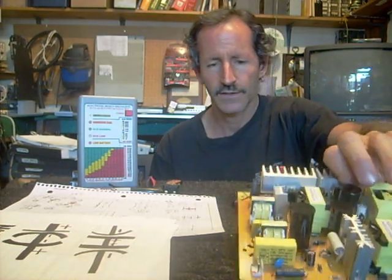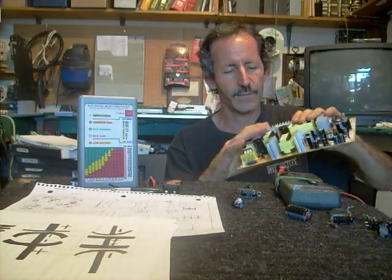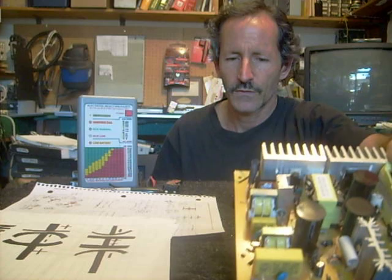So if you can find a reputable company like Digikey, learn to use their website and learn what to look for as far as the operating parameters. You want to make sure that you get a capacitor that can handle the heat, the correct voltage, correct microfarad value, and the correct size — sometimes size is of the essence. When you're dealing with these new circuit boards and LCD TVs, you can't put a big massive capacitor on here and expect to put the cage back on it, although I have put them in sideways with extended wires in a pinch.